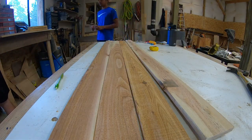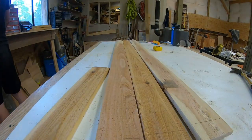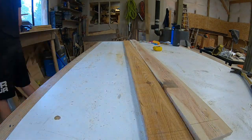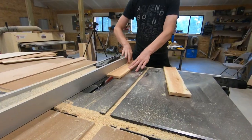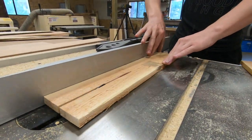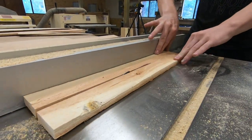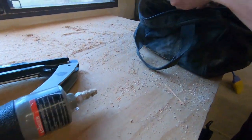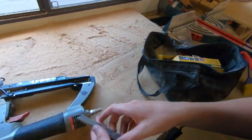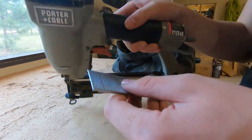For the slats, we used cedar fence planks. This was a good option because the cedar planks are really cheap and are rough cut, which means they grip bike tires super well. I also cut two of the planks in half on the table saw so we could put them where the jump curves up to make a more smooth transition. To secure the planks, we actually used one and a quarter inch nails. While these don't last as long as screws, they're a lot cheaper than actually using 60 screws.